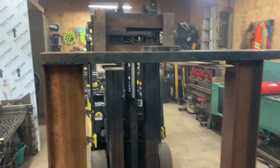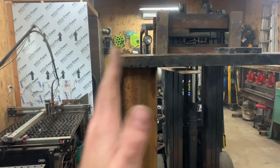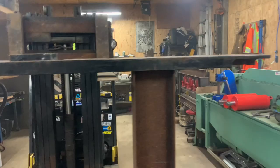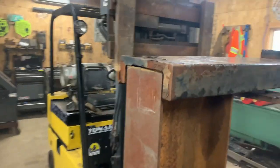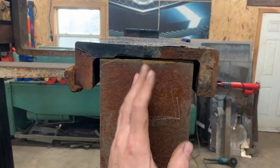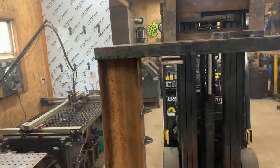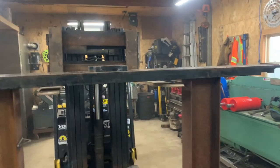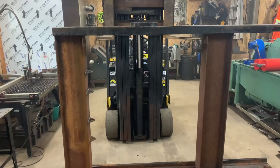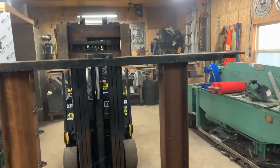There you have it. It was actually very easy with the forklift because I had the side shift available — that allowed me to line it up fairly easily instead of trying to push and beat on it. The one thing I did mess up, and I've always got to mess up on something — that's kind of how I learn — is I forgot to clean off the seal face inside here that I'm going to weld to the C-channel. That paint is actually not that thick, so other than that, that's a pretty cool frame. That's kind of what I had envisioned. I'm going to have to tack the hell out of it so it doesn't break off, but I've got to tack it overhead, which kind of sucks because overhead welding is just terrible.